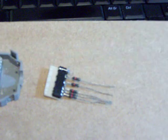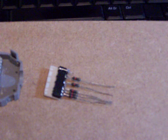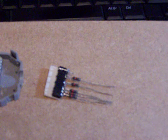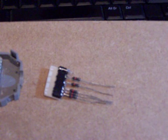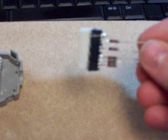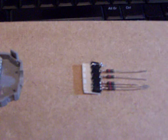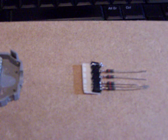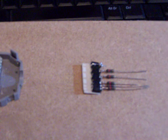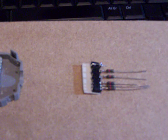I've got to get it so that the resistors which are on the output lines — which is pin 3 (TMS), pin 5 (TCK), pin 7 (TDI), pin 9 (TRST), and pin 8 (TDO) — are in place. And going off from pin 10, which is the ground, which is also tied into pins 19, 20, 21, 22, 23, 24 and 25 of the DB25, also tied into pins 19 and 12 of the 74HC244.